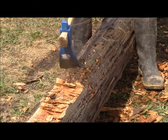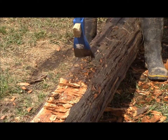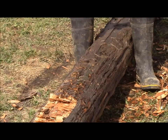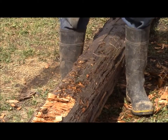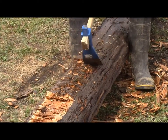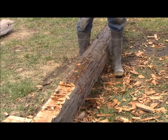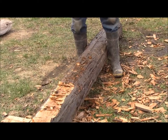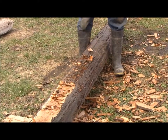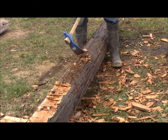Tomorrow, when I go to do my second post — because it is getting later in the day and this is the only thing I've done all day — I'm going to get out my crosscut saw and show you how you can cut your relief cuts in here. You can cut relief cuts with any kind of handsaw or a chainsaw, whatever you like, and then just knock it all out and smooth it all down with your adze. I'll just keep working around this knot a bit so it keeps sticking out kind of rustic.